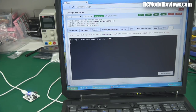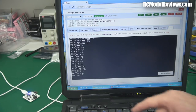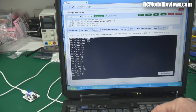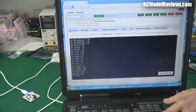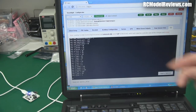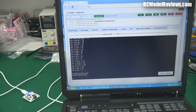I like to turn off that motor arm facility. If I'm using CPPM I need to enable the CPPM function, but in this case there's no CPPM so I don't need to. To turn off the motors spinning on arm, I just type in: FEATURE space MOTOR_STOP — and when I hit enter, it's simply told the board to stop the motors when armed and not leave them running. Simple enough.